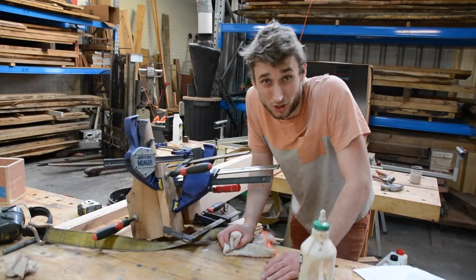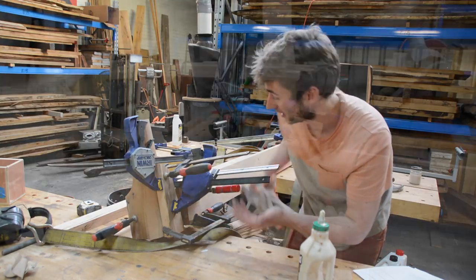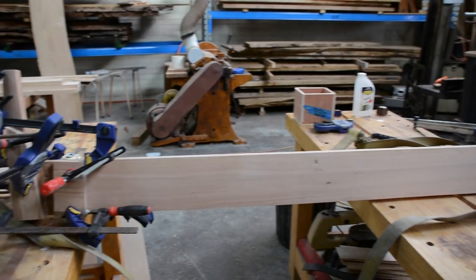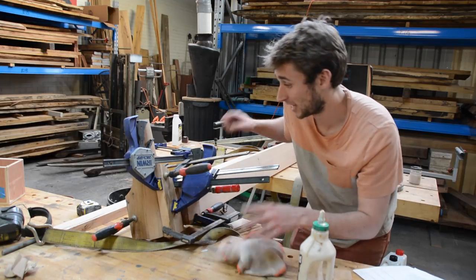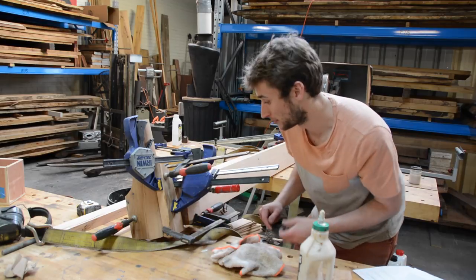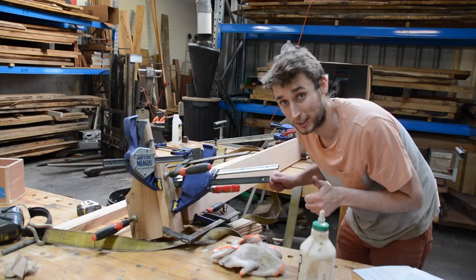Okay, well that did not go to plan at all. The strap just couldn't get the pressure needed to close these gaps, so I've come up with a real throw-together arrangement — clamped some blocks onto the outside of the legs and basically just kept throwing clamps at it until everything would hold. I've closed those gaps and now I've got nice tight closed joints and everything should dry nicely.